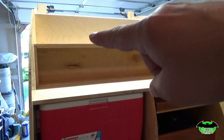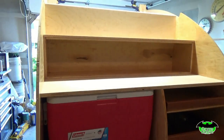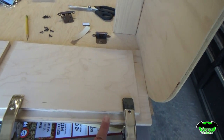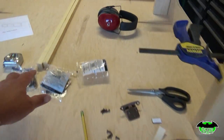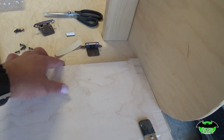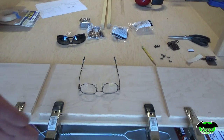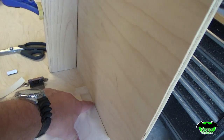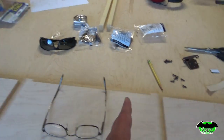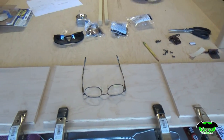Right now we're going to go ahead and install the doors on the face. I've got three cabinet doors — they're already cut and ready to put the hinges on. The face of the cabinet — I have a couple of sticks here, they're three quarters of an inch wide. I laid them on the top and the bottom, and that centers the cabinet doors top and bottom. The space from the side edges is an inch and a quarter on both sides, and then we just evenly space these — they're about 15 to 16 inches apart.